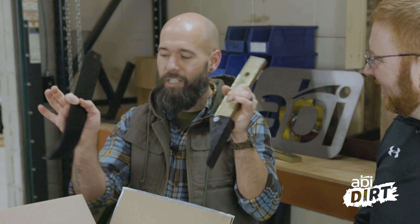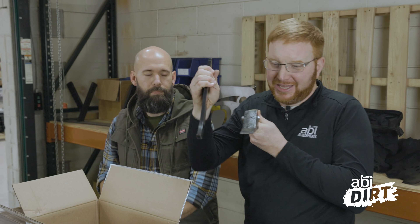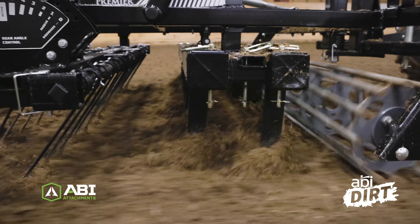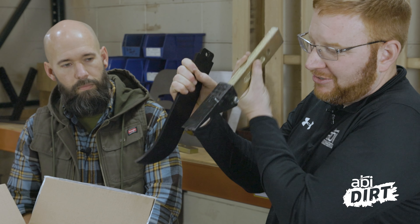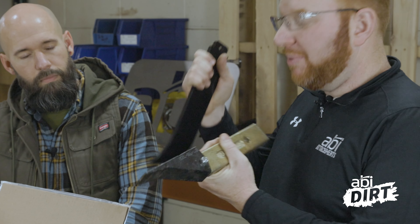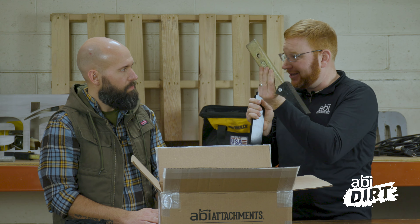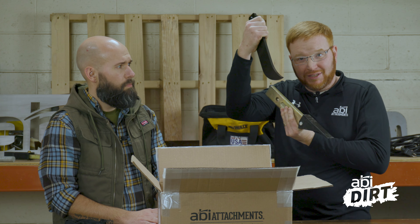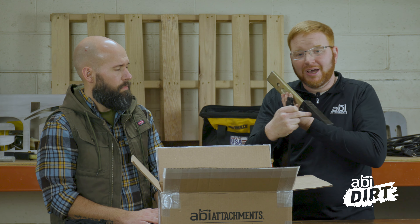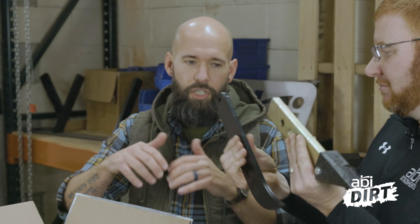Scarifier complete. But look in the box — you didn't tell me there were two things in the box. Why the heck do we need two different kinds of scarifiers? One of the first contrasts is the thickness. In our high fiber sport pro line, we need a thinner scarifier so we don't have extra buildup. If we try to run a scarifier like this through that material, it's all going to wrap up, ride up, bunch up, and plug. But if I'm working in a gravel driveway or fracturing heavy clay or prepping a seed bed, I want the big scarifier. These are also made out of an abrasion resistant steel to make them last longer, but the replaceable tips are the way to go if you're working in those other varied materials.